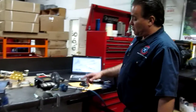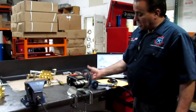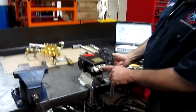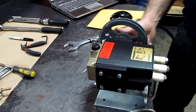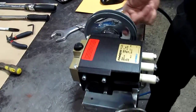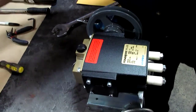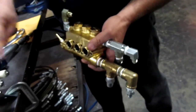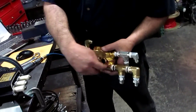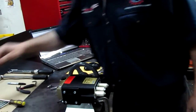Going back to how a pump runs: as the engine turns it turns your pulley, and these are called plungers — they stroke in and out. How do we get pressure? As the plungers go into the packing and get sealed by the seal area, for every movement back, water enters the pump.